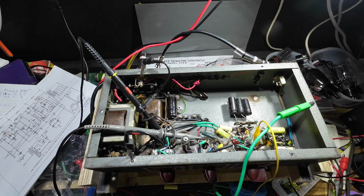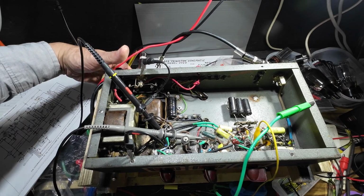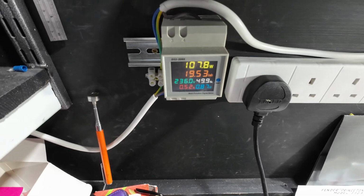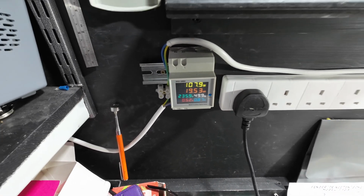Well, I thought I'd have this finished by dinner time. More problems arising. So before we do any more testing, we're going to let this thing cool down a bit, and we are going to put that 5Y3 in there. That'll drop the bias to 18 watts, and I think that's more than enough for this amp. There we go, 520 milliamps. So that's drawing 30 milliamps less.